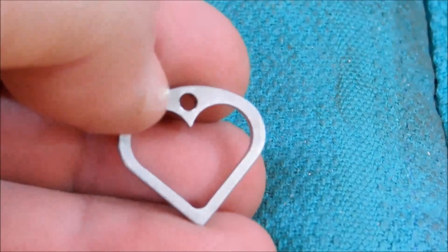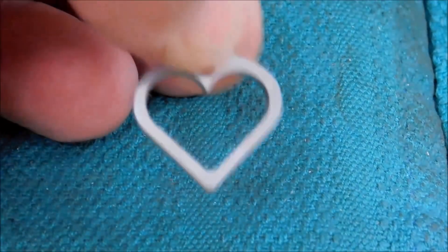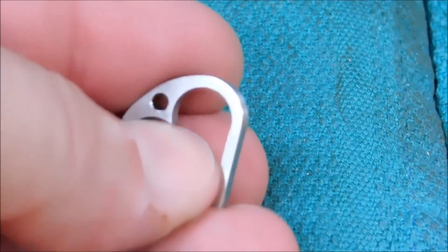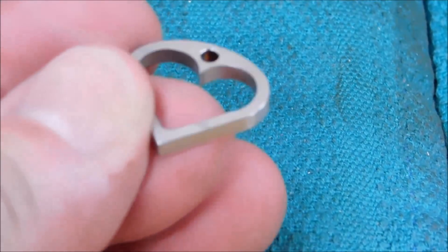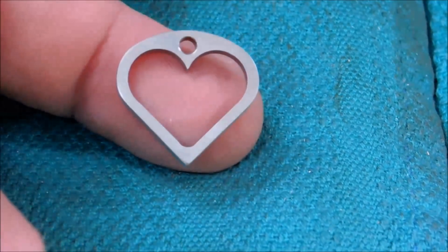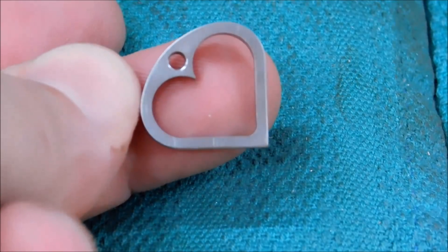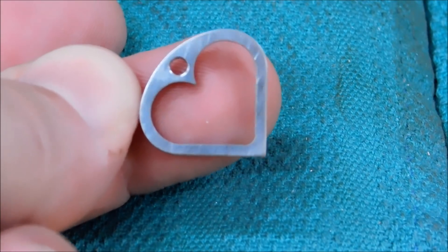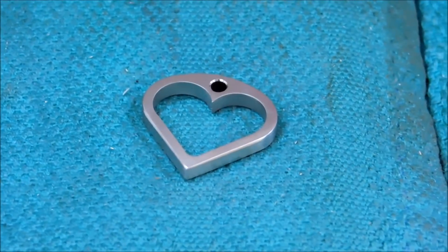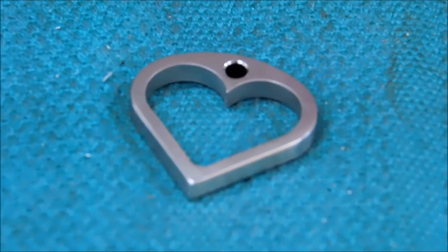I'll shoot it with some alcohol, soap and water and take a picture. I like it — I'm not going to make an eyelet out of the top because I just don't think it's worth it. Hanging on a pendant with a link in the top, you're going to see the inside and really not pay attention to the outside. The finish came out really nice — like a mirror on that one side. Well, there you go guys. Not impossible to make a heart on a manual milling machine. Just approach it from 45 degrees, use finished corners, and make sure you don't use a blank so small that halfway through the operation you crush it with the mill. Hope you like that — gives you something to go kill a couple hours on. Appreciate you watching. Joe Pye, Advanced Innovations, Austin, Texas. I'm out.